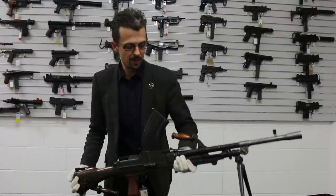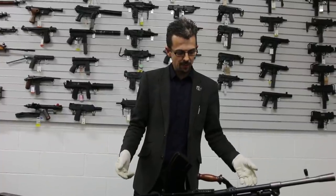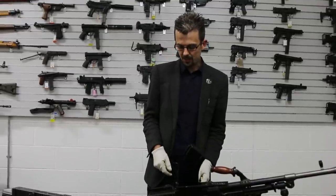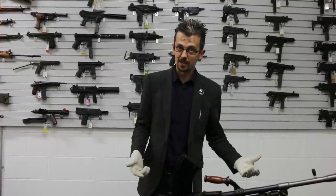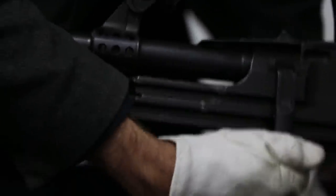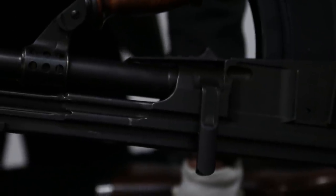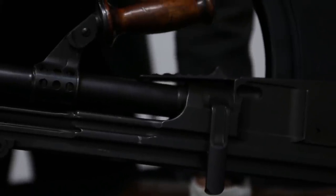There's a plaque on the side which we can show you in close-up. It's complete to its original specification for the Mark 1, with the correct barrel and this folding handle at the back — which was for grasping and also to help you use it in the anti-aircraft role, which we see in the film. On this early gun there's a dovetail mount for an optical sight that wasn't actually issued during the war. You've got the barrel lever here, barrel nut — if you pull that up, the barrel just slips straight off the front. With a machine gun, it's important to replace the barrel every couple of hundred rounds of fire to let it cool, so you'd swap the barrel over.